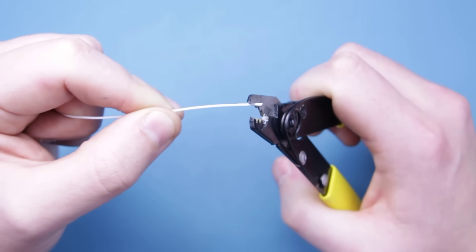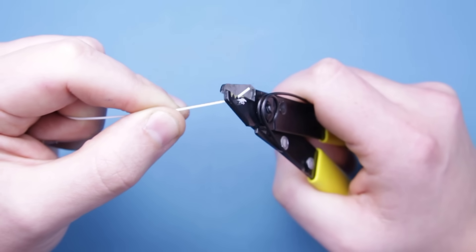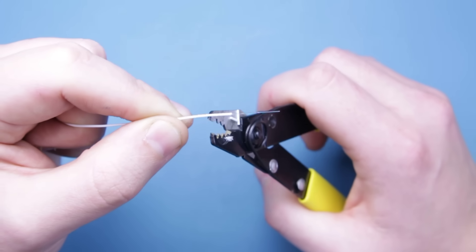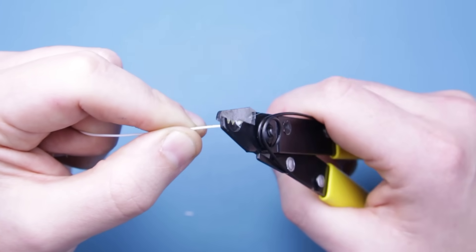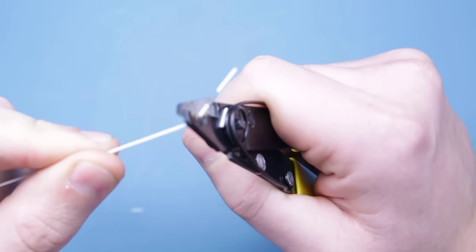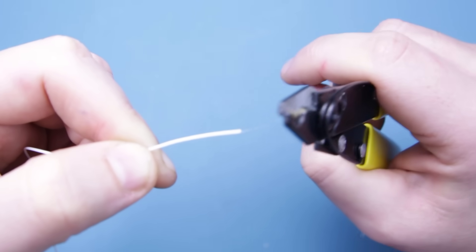Here are the strippers I'm going to use. As you can see, there are different sized grooves on these strippers which can remove different layers of the plastic coating and are suitable for a range of fibre sizes. The best advice when stripping a fibre is to nibble away at the protective coating and remove it in small layers and sections. There are several different layers which you can see as you start to strip them away. You want to aim to strip off about 30mm of coating on both fibres for a good fusion splice. If you clamp too hard or try and remove too much in one go, you're very likely to just snap it. And here we have it — this is what a bare fibre looks like. If you run it through the strippers then there should be zero resistance. It's always worth double checking.